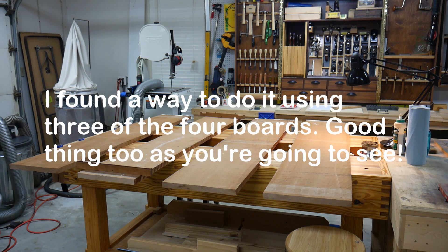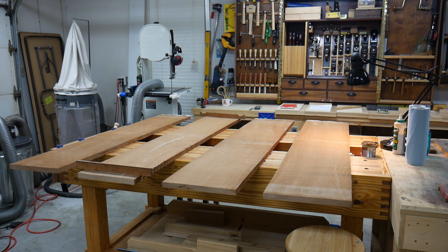So what I want to do first before I do anything else is try to understand how flat this stuff is and how much work it's going to take to make it flat and true. These projects never work very well if you can't get the wood flat. Now one way we do that, and it's a really old-fashioned way, is through the use of what we call winding sticks. I've got them sitting on one of the 12 inch boards right now and basically all we have to do is just sight down those things to see how much twist the board has in it.